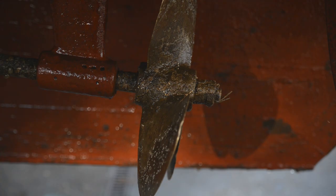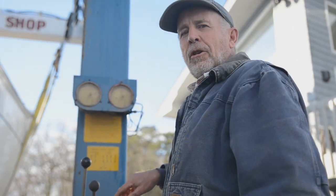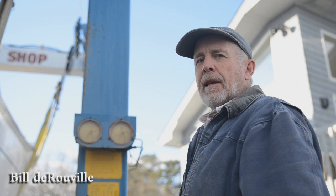Initially as the boat came out of the water we're looking for planks that are deformed, that are bulging, or if they're not fair at all. We're also looking for caulking that might be coming out of the seams, plugs that are missing, any indications that things are moving and out of shape. But so far everything seems to look a lot better than we expected, so that's a good sign. A lot of gear and hardware has already been stripped out of the boat, so right now she's weighing in at around 39,000 pounds.